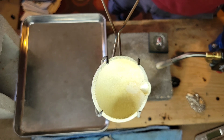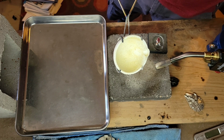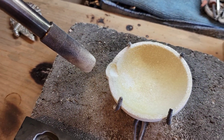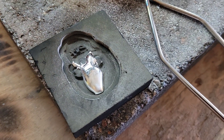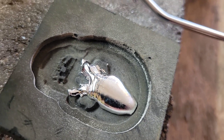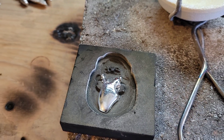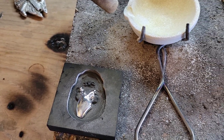If you did find that you missed some spots after doing your first melt, you could go back and do another light layer of glaze with the borax if necessary. Had I not glazed this, that silver would have melted and stuck all over the sides. Here's a closer look at the crucible after that glaze and first use — the silver came out clean with no extra borax on it. If you do get a little extra borax, it will come off with some of your first pours, but keep in mind if you're trying to pour a really clean bar, you'll have to buff or polish that off.